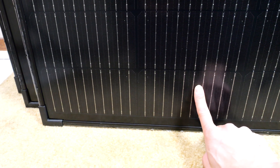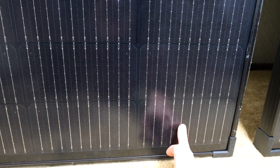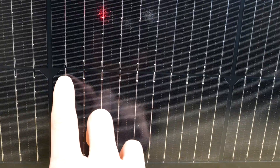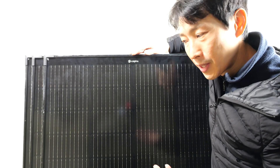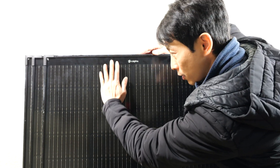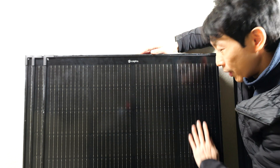At the end, it connects to something behind this black bar. The second column looks the same as the first. You've got two 15-cell strings going to this line, connected to these two 15-cell strings of half solar cells. The reason they cut them in half is that if you cover one of the strings, the other string will still work. If you cover one column, you'll still have 100 watts from the others. So it makes it more resilient to partial shading.